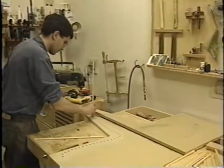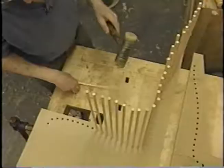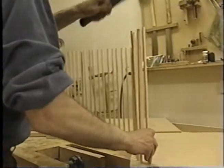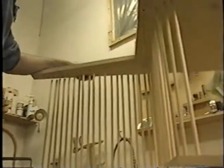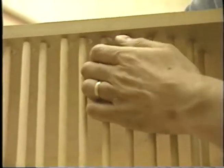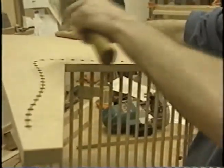The dowels go into the side with the stop holes first. It's fun to see the contour take on a 3-dimensional shape. Putting on the other side isn't as hard as it might seem. The trick is to work on just one dowel at a time. Hold the side at an angle so you can do this, and be sure to keep tapping down the dowels you've already fit. Slowly make your way across the bottom, then up the chair back.